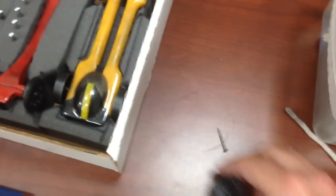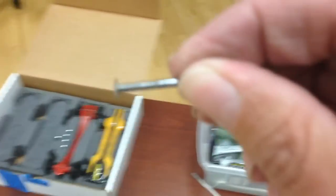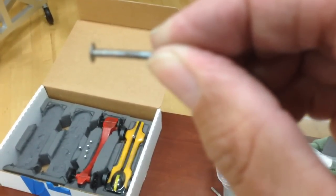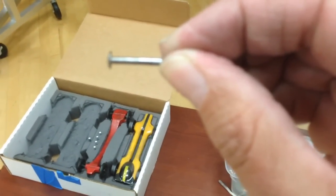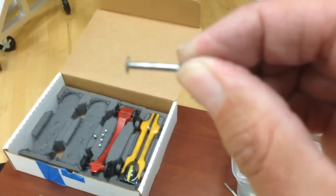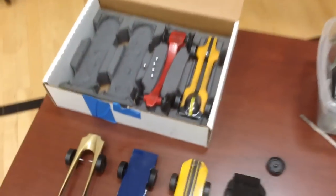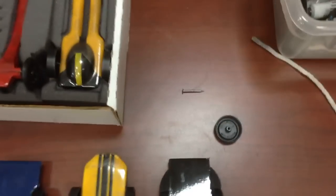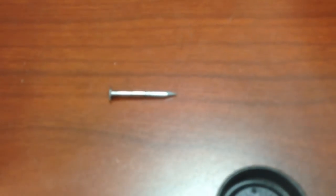Let's start with working on the wheels and axles. With the axles especially, you want to get these polished — put the axle where my fingers are and just spin it in the drill. First use a file and get all the burrs off, then eventually get it up to 1500 or 2000 grit sandpaper, just spinning and shining it.